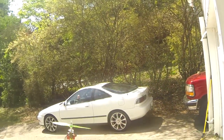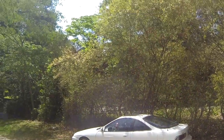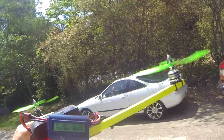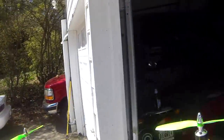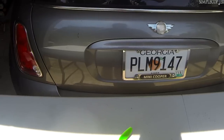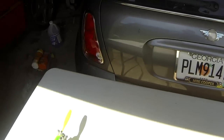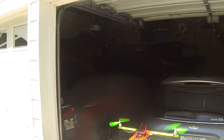Alright, we've got some safety glasses on. This is a three-cell battery. Alright, 56 amps at full throttle. I know the Sunny Skies pull more, so I'm going to fly them a little bit and show you the kind of performance it has with the three-cell battery, and then I'll show you what it does without the props on it — the reason I'm not real happy with it.